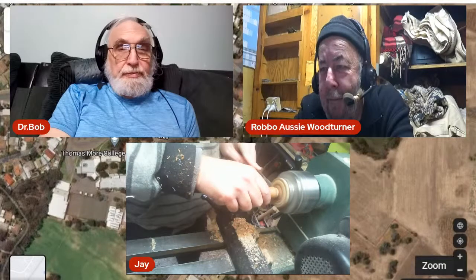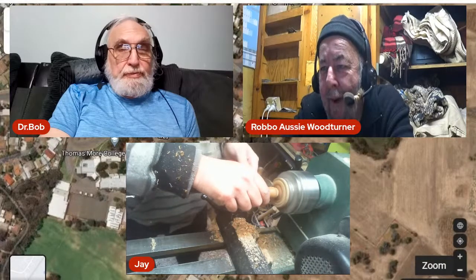Not that way, Jay. Always small side down. And personally, I'd cut that off with a skew chisel so that it ends up nice and clean rather than using a parting tool.